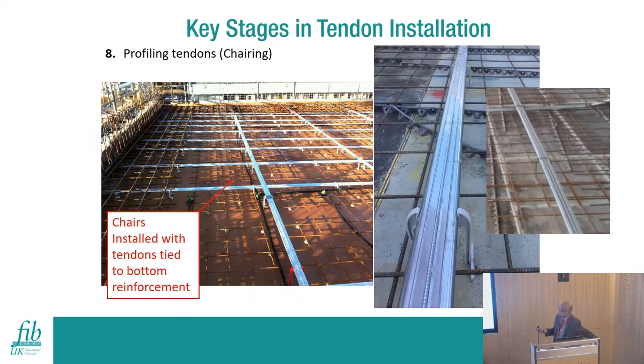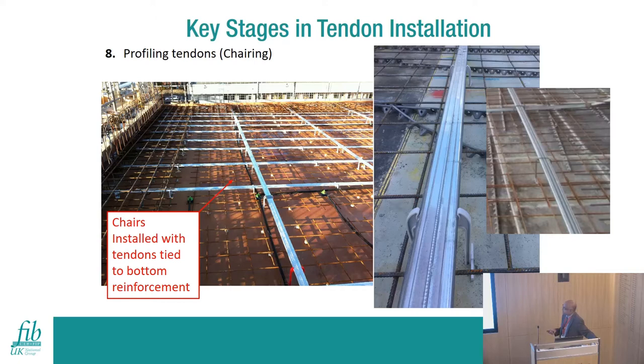Once done, you set the profiles. Nowadays we use a bottom mesh throughout, and you can either schedule chairs on top of the bottom mesh for a staple-free installation at the bottom - so nothing is visible on the underside - or install directly on the deck, allowing you to mark the tendon position for future reference. Both plastic and steel chairs are available. Steel chairs have a heat-treated plastic coating at the tip to prevent corrosion or water ingress from the soffit of the slab.